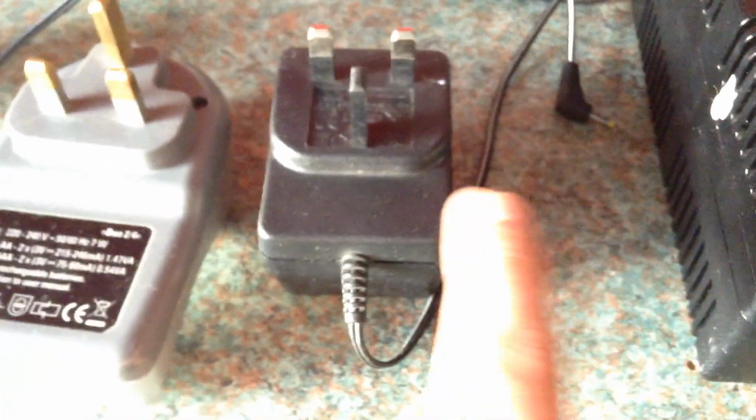And these are various chargers. The charger for the power drill, charger for the hedge trimmer battery. This is a double AA battery charger. This is a charger for my Bluetooth Sony headphones. This is also true for all the devices down here, for the e-bike charger and the metal detector battery charger. The charger for the electric bike does have 3 wires in the mains cord, but the charger itself is plastic. The whole enclosure is made of plastic, so no need for grounding.